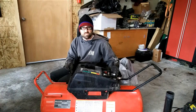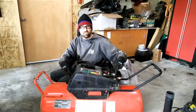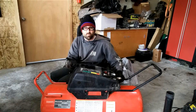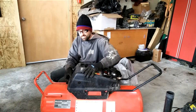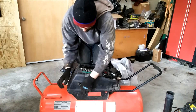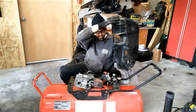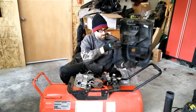I'm going to go ahead and take apart this top. It's got two Phillips head screws, one on each side. Once you take those off, it's going to have some tabs around the edge that you're just going to pop loose. You can use either a plastic tool or a screwdriver. Once it comes apart, just lift up to a vertical position and it will lift right off. Kind of lean it forward, pull it past your outlet, and set that aside.